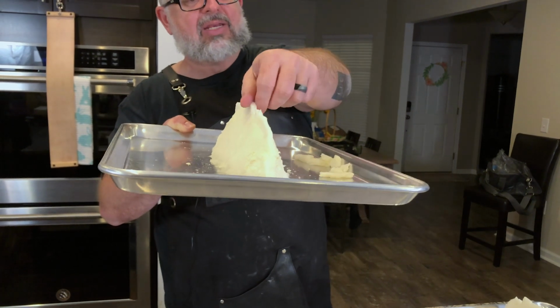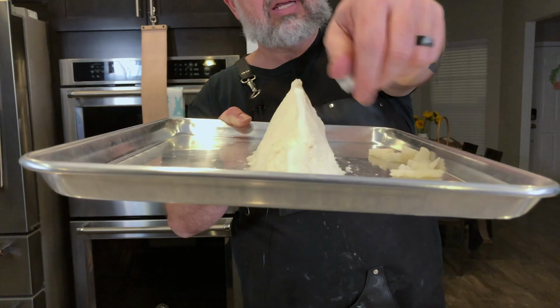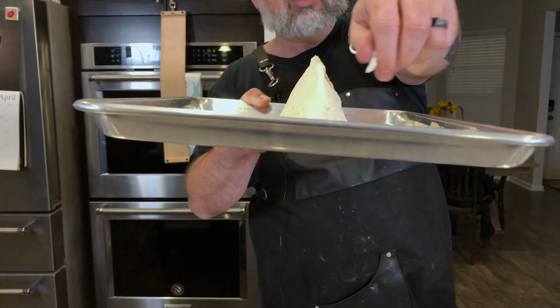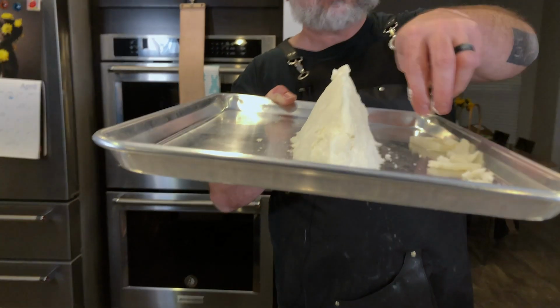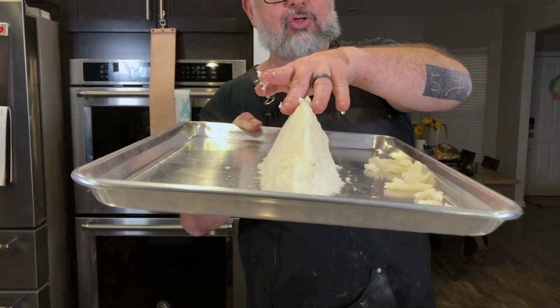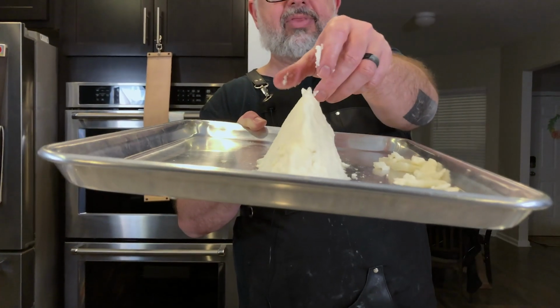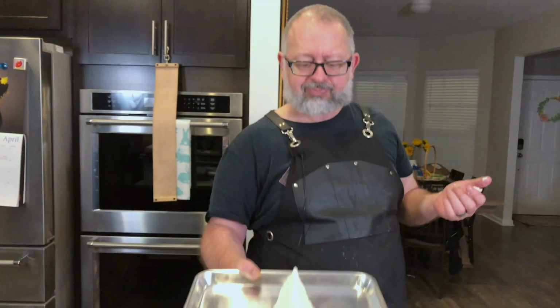And in the end, you can already see that the apex of the knife is being exposed. Like the triangle that made up the knife was below this burr, and it's already becoming very evident as we remove it. Look at that triangle, you know? So we rip all the extra away, and we're going to be showing you techniques to do this.